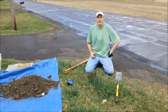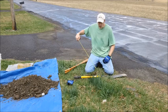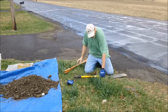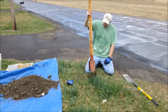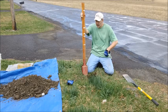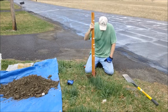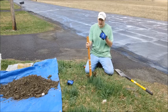A little tip: whenever you're digging a hole like this, when you need to know the depth, just put a shovel across the hole or a board, measure down to the hole, and you line up right across. Or better yet, what I like to do on my post hole digger is just mark various depths as I'm going. Today my hole I'm shooting for two feet, and I don't have to stop with the tape measure — I just stick the post hole digger in and see where I'm at. Two feet.